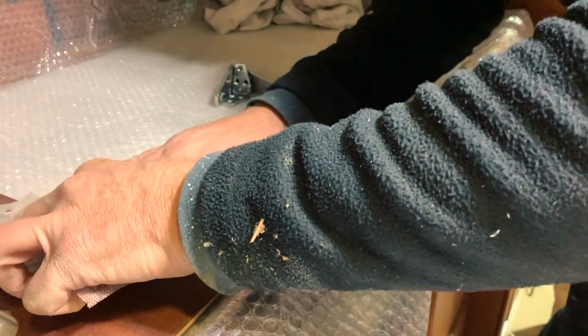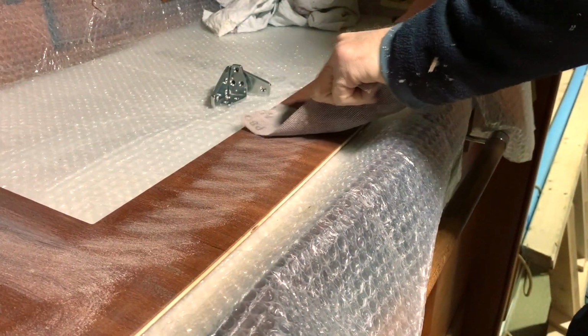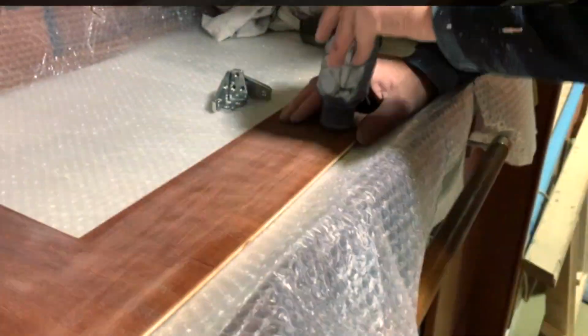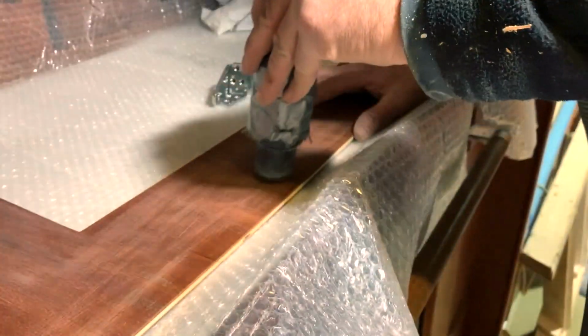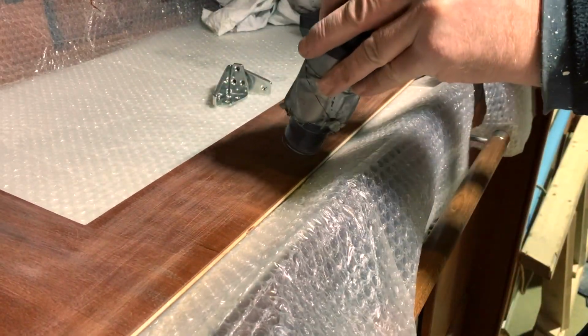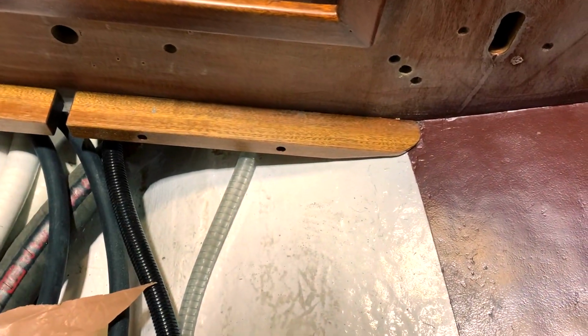Now we clean. Another important thing to sand is the back of the panel, because also here the silicone or the glue needs to be used, and in this way we have a perfect bonding. All must be very clean and without dirt when you bond 2 pieces of plywood together, so cleaning is the base of a good result.